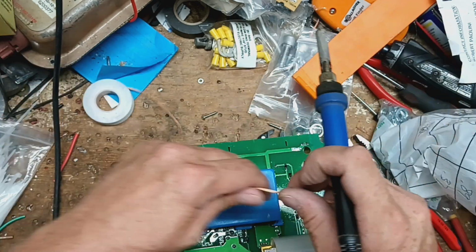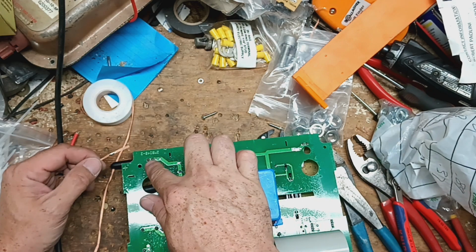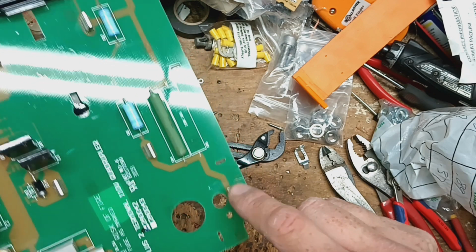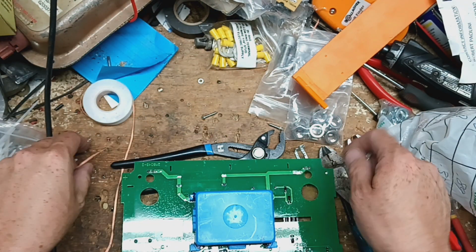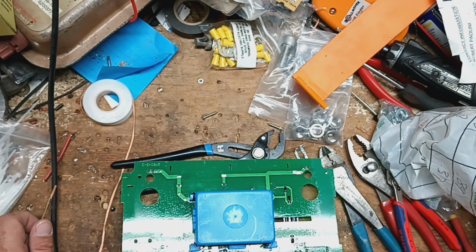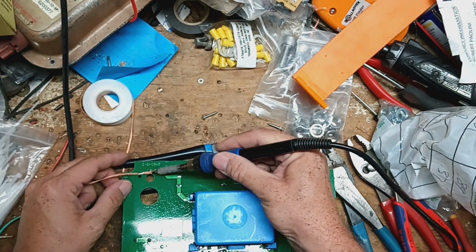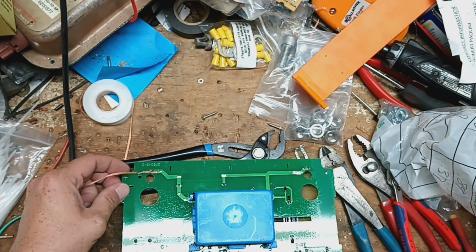and I'm going to heat the solder up, and I'll pull the spade connectors that are on the front side here. There's one there. And one there. We're going to heat the solder up, suck the solder off, and then we're going to pull those off. See the solder on it heated up. Yeah, we got to get to about 725, 750 degrees Fahrenheit. All right, we're at 770. So that's hot enough. So we're going to melt this solder and heat it up. Clean the tip first.